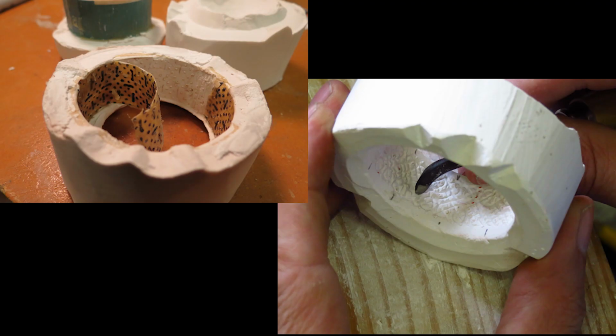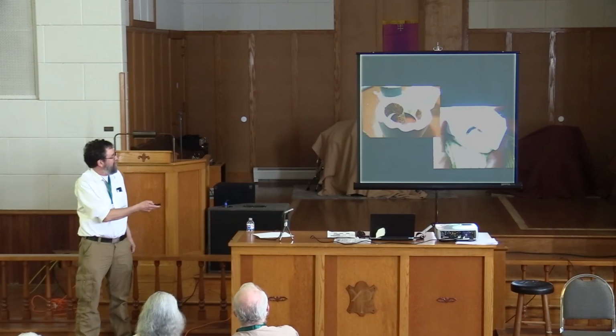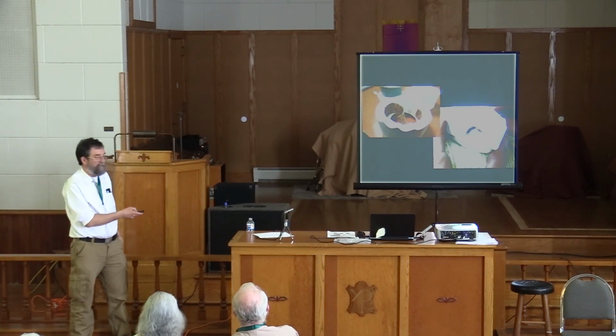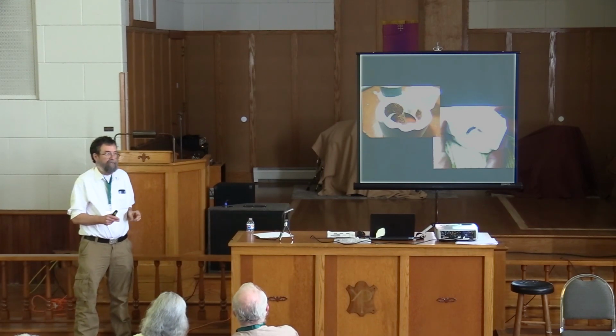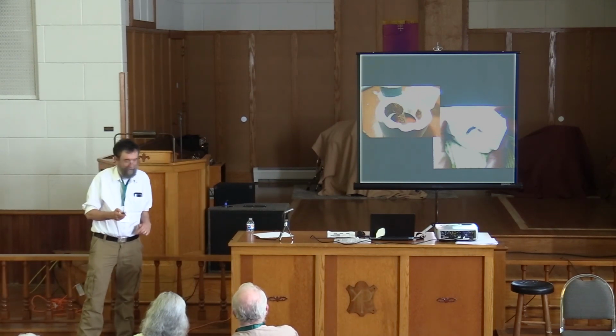So anyway, there's a three-part mold system I devised for this. And this is just, you can see on the viewer's right, carving on the inside of the cylinder. The cylinder was made around a core, and then there's a third piece that's just like the funnel and the method to get it all together. There's going to be a few other views of it. Laying it out on the inside proved to be the hardest thing to do. The cells of that piece, those of you that are familiar with the five-dot grid, each cell would be about 2.1 millimeters. For those of you that speak Fahrenheit, it's like 3/32 of an inch or so.